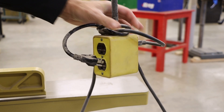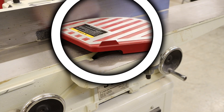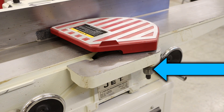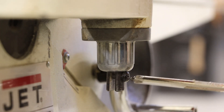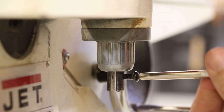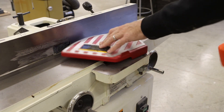Taking a look at our swing guard, we want to locate the point at which it goes through the machine. If we swing that guard out, we gain access to one Phillips head screw that we need to remove, and we can then work that guard out.